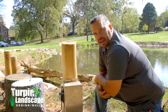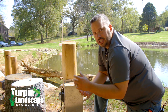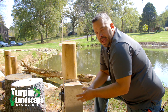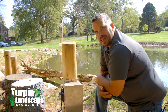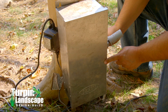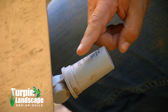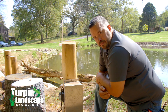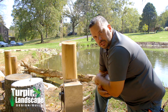Hey, it's Jason. I'm here today to talk to you about a low voltage lighting transformer. Sometimes you need to make a couple quick adjustments, such as resetting the timer — you're wondering why it's on during the day. This is the transformer itself, and this is a photocell. What a photocell does is it turns the lights on as soon as it gets dark out, and then we use a timer to shut that off.